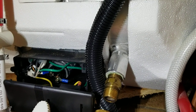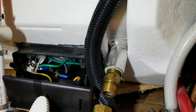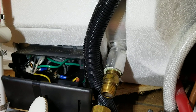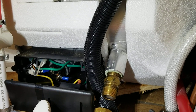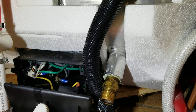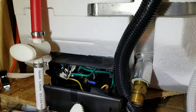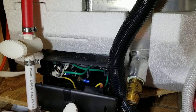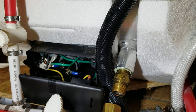That is why Atwood actually recommends — believe it or not — that to replace the heating element, you pull the whole hot water heater out of the side of the RV: 16 screws, break the silicone seal, take it all the way out, undo the LP, change the element, then reinstall the whole unit. Because mine was just singing, I'm going to button everything back up, and if it does fail I'll switch to gas and make the painful repair when I have to. What I'll probably end up doing is clearing out the wiring, having the big shop vac ready, and maybe sticking a tube into the drain hole to suck more water out of the bottom of the tank first.